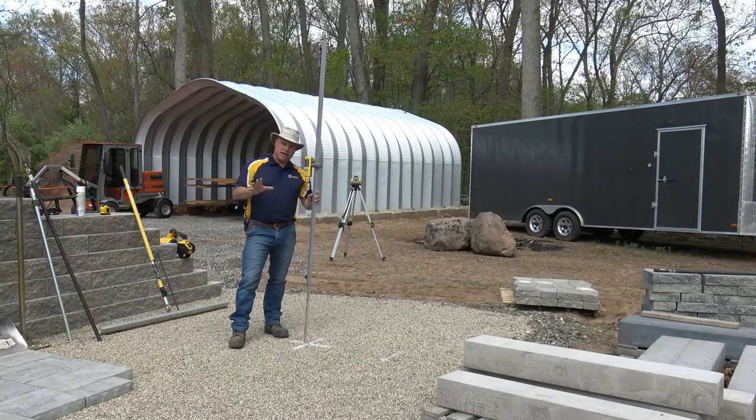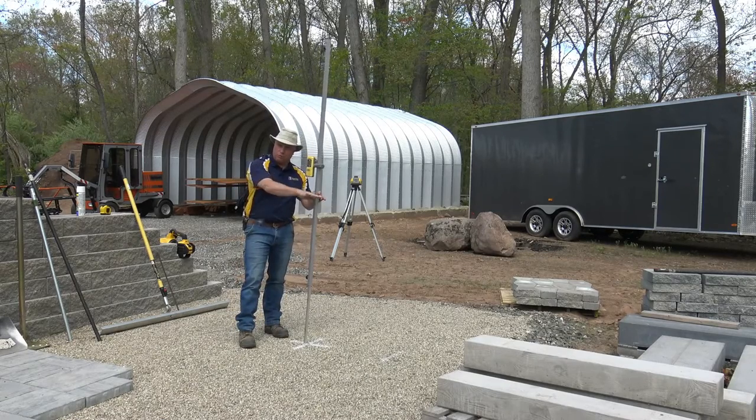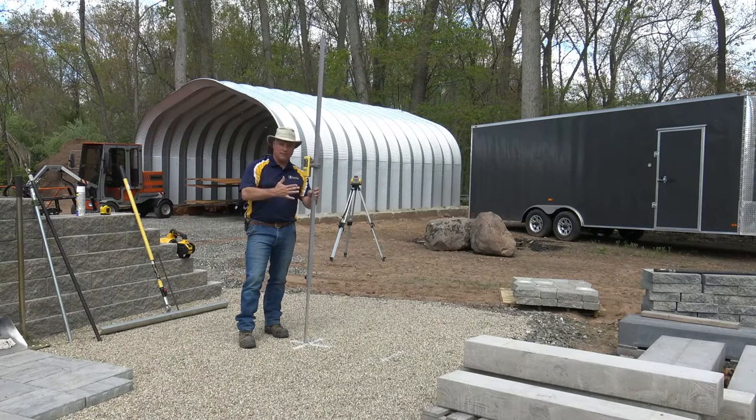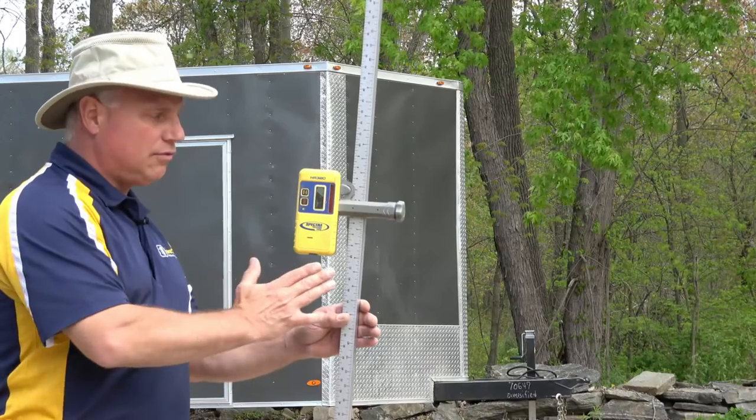The next process would be to establish the height of what I want my fire pit ring. I generally will choose the center because if this has got a slope through it, I'm going to want to dig part of my fire ring into the higher end and the bottom side will raise out of the base just a little bit. Again, 3/16 pitch, I'm running across approximately 4 feet, 4 times 3, 12/16, so 3/4 of an inch. So basically if I'm 3/8 of an inch into the base on the one side, 3/8 out of my base on the other side, that's my happy medium point. That's why I always choose the center of my fire ring for that elevation height.